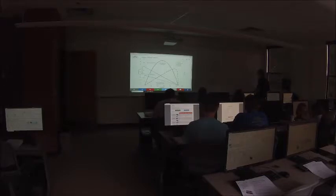So basically, those two forces fight each other. And so as you can imagine, if I'm applying 12 volts of electromotive force in the direction that I want the motor to go, but the motor's not turning, right? The motor's stationary. And I just hook up power, I flip the switch, right? I turn it on. Okay, the motor's not moving, but I'm applying 12 volts to it, okay? It's not generating any back EMF, okay?